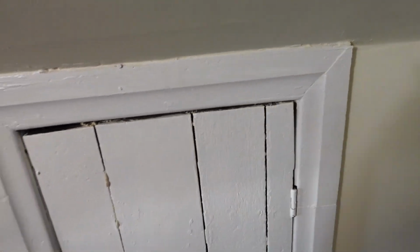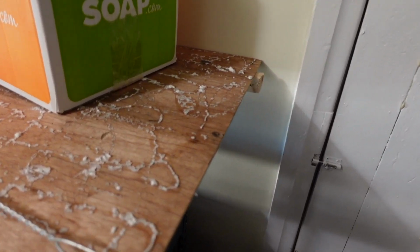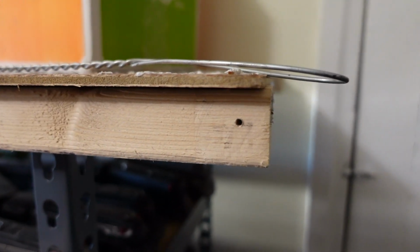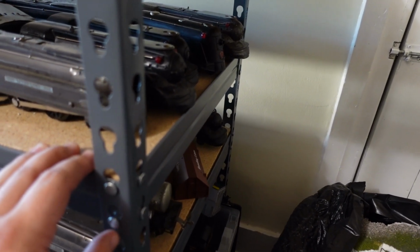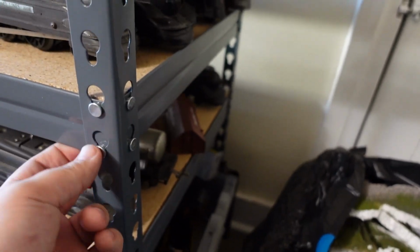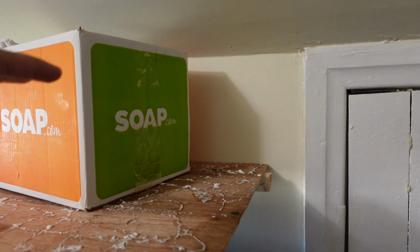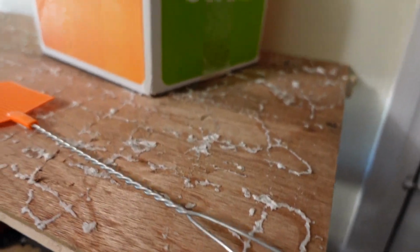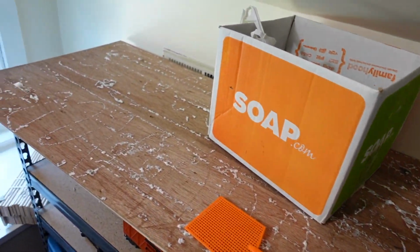And we're going to mount them up using these shelves. We're going to marry up to these posts right here, go up from the bottom here. We're going to use this as like all our bearing force pushing down onto this shelf, which are very strong. These are like riveted metal pins. We'll put the stick lumber in. We're going to drag her up to right about here. Then we'll just lay down our 1/8 inch ply. So that's the idea. So I'll show you guys the progress as we move along.